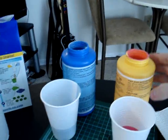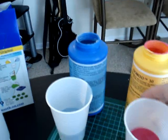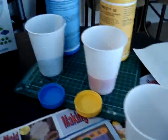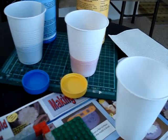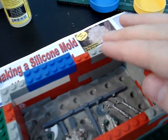The other two things we're going to use are mold rubber — it's two parts, there's a pink part and a blue part. We want to do a one-to-one ratio and I've got a separate mixing cup to pour them in. I'm going to pour them into the same cup, mix them together until it's a very even purple color, then start pouring it into one corner of the mold — nice and slowly — and it's going to roll over top of all the detail.